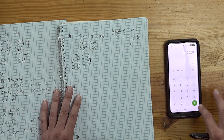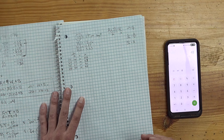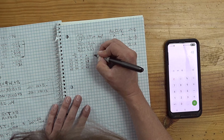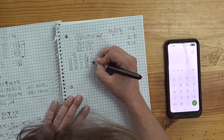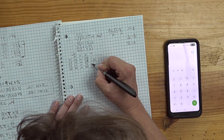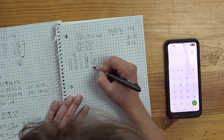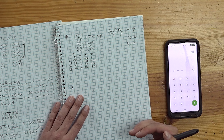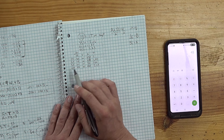What I'm going to do now is plug in a formula that tells us — this isn't going to be the exact torque units, but it will tell us the relationship between amps and torque for each of these. Originally, what I was going to do is make a formula to find the brush resistance plus the resistance of our armature, and then find out where that meets in the middle — where is the brush resistance equal to the armature resistance? That is what I thought was the ideal motor for producing torque as far as a brushed motor. When I actually ran through it, the results didn't match up with what I thought they should be, so we're not going to do that right now.